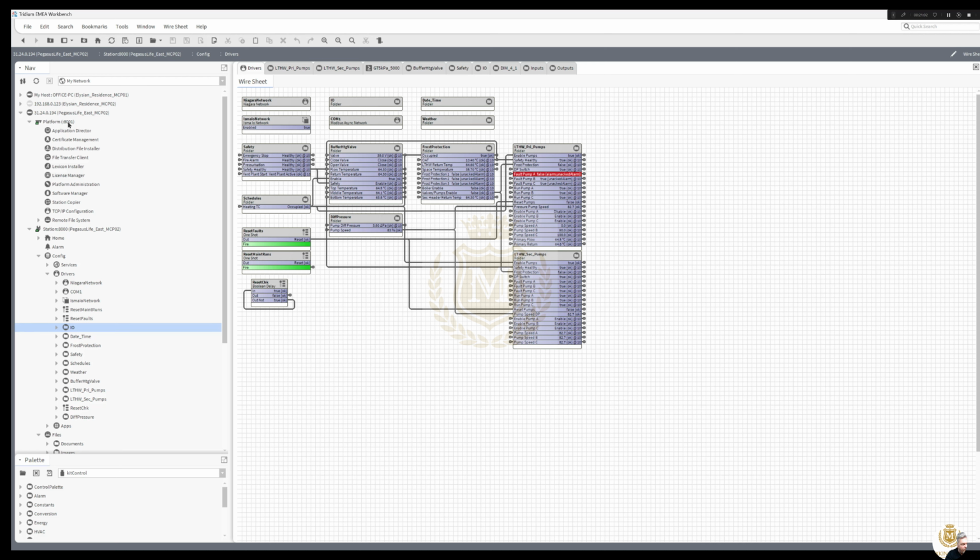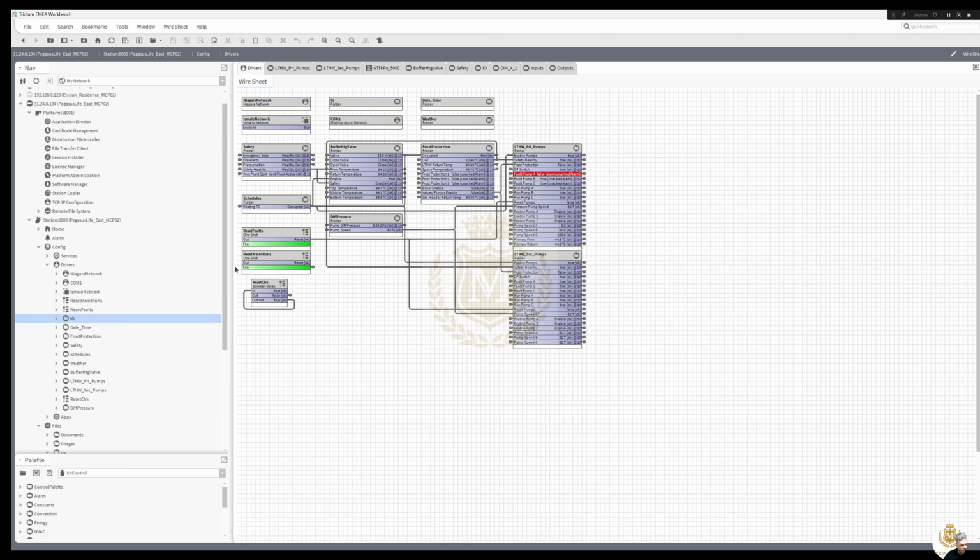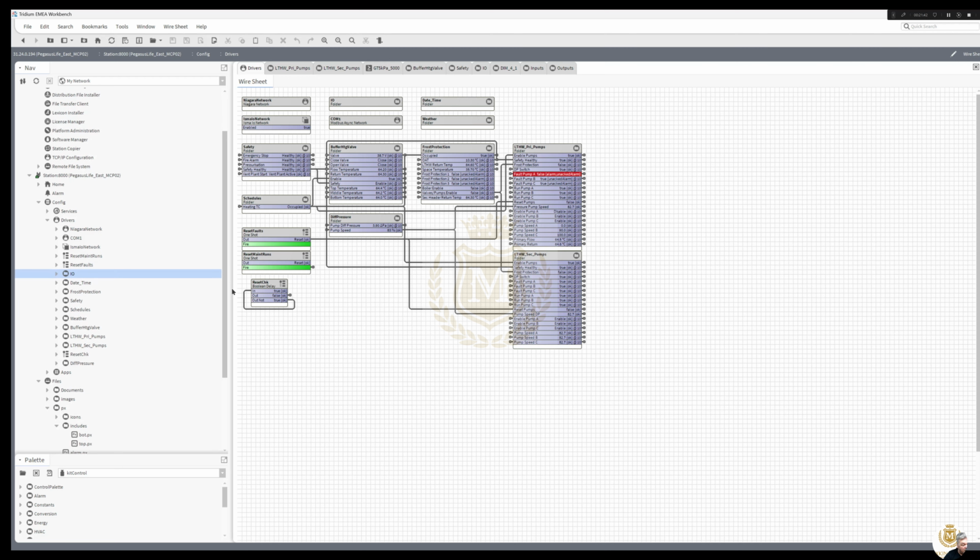So you've got another party, another engineer coming to site to work on the system, not you. And they say, well, the username's this, the password's this, can you get into the controller? They then try 4911, no. 1911, no. Okay, we get platform 5011, no. 3011, no. No, sorry, I can't get in. End of story. So unless they know what the port numbers are, they will not really be able to get into the system. So that's an extra security benefit.